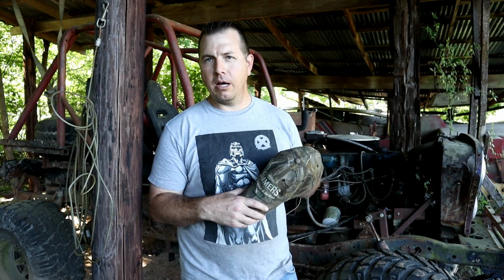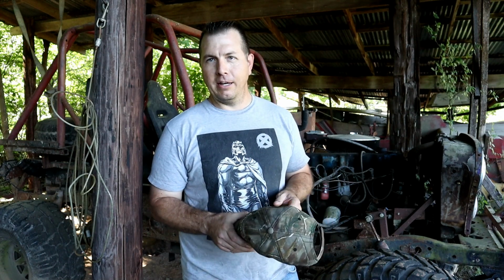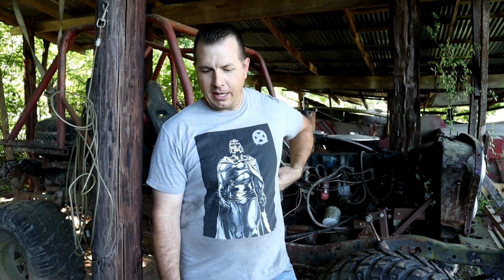I've since upgraded it to a 4-barrel Offenhauser intake, header exhaust, and custom exhaust on there. Came with originally a 3-speed transmission. I upgraded that to a 4-speed Borg-Warner T18A, which has got a super low unsynchronized first gear for rock crawling. Cut the frame, extended it, Dana 44s, fully locked, front and rear, and what else? Tube cage. Took the crusty, rusty body off.